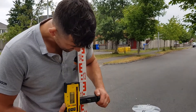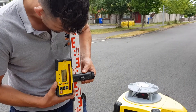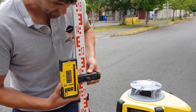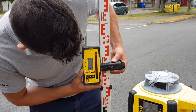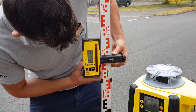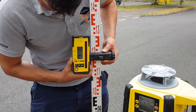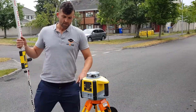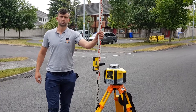So I'm going to use the digital laser to tell us how far below the mark. I'll go down to 1.22 and level it up — and that's telling me it's 5mm below the 1.23, so it's actually 1.225. I'll tighten that up again. So that's how to read the staff — at the moment the staff is reading 1.225.